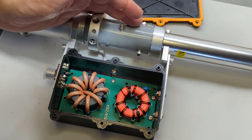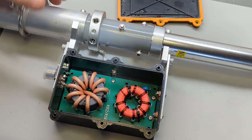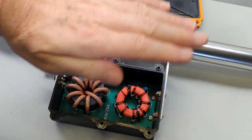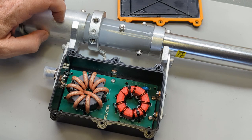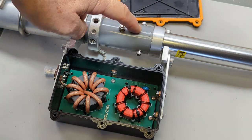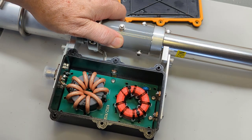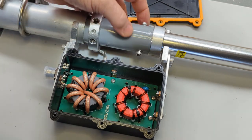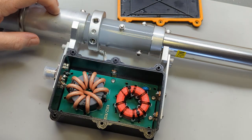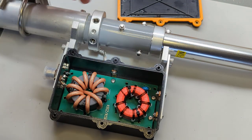And that makes it a very tall antenna, which of course requires quite a bit of robustness, at least in these parts here, so that this axial bending - this total wind-driven back-and-forth, if you don't have this thing completely guyed - is going to eventually make itself known, probably down here where the first element fits into the PVC insulator. That's why they have these two through bolts at 90 degrees, which is supposed to create enough strength to resist the axial bending that, over time, might have something to do with killing this thing.